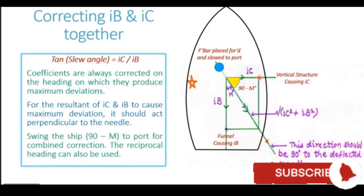The resultant can be easily obtained by making a parallelogram. If you make a parallelogram using these two IB and IC vectors, the diagonal of the parallelogram gives us the resultant of these two forces. Now we can find out the magnitude of this resultant by using the Pythagoras theorem. It will be equal to the base square plus the perpendicular square under root. That is IC square plus IB square under root will give us the magnitude of this effect, which is the resultant effect of IB and IC.